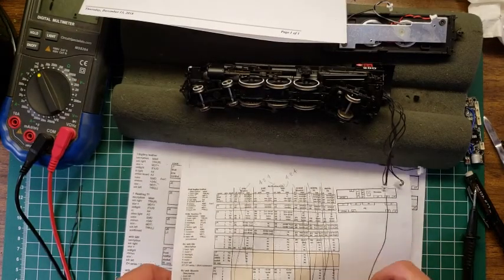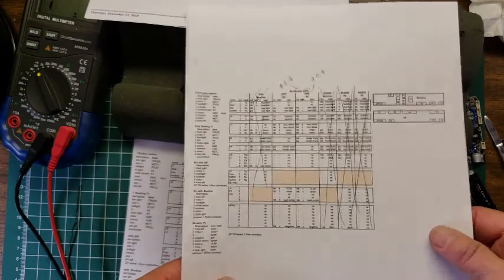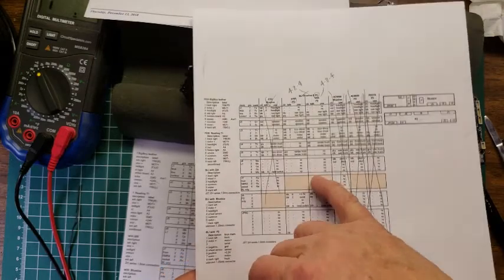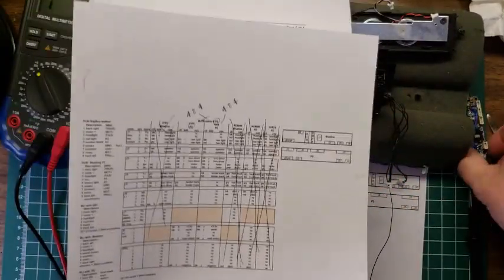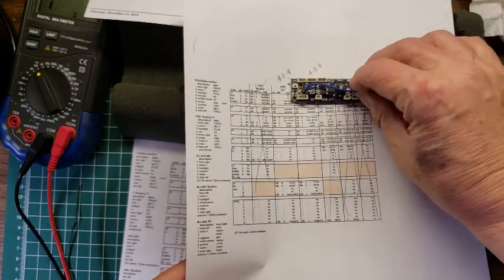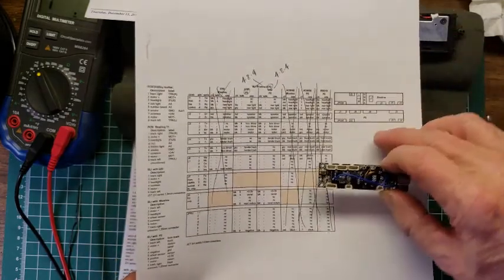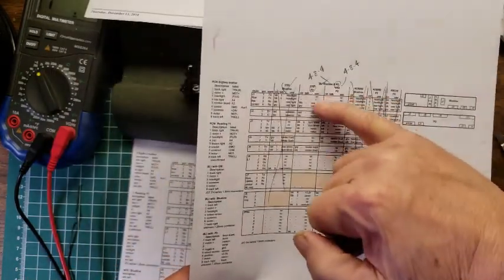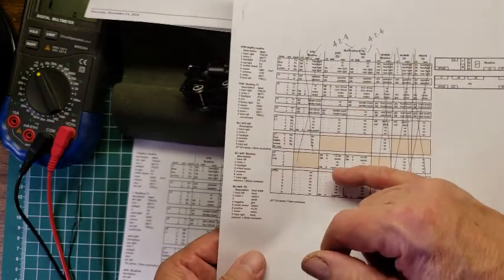Okay, so I'm working through some of the combinations, and I've got 2 of these sheets. One that I'm starting to mark up here, and it's obviously not any of these or this one. It could be one of these 2. But these were both for Paragon 2. This is a Paragon 3 engine because one way you can tell is, I don't know if they're all blue or not, but this wire is the antenna for Paragon 3, and this is still a Paragon 2 type format. So based on that and looking at some of these that are here, it matches this pretty well. But it is just not a Paragon 2, it's Paragon 3.